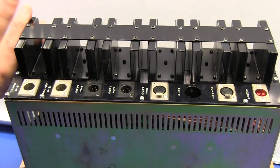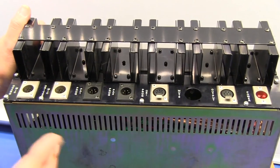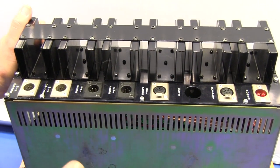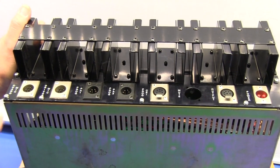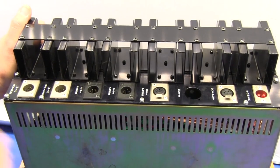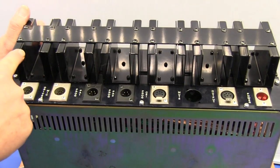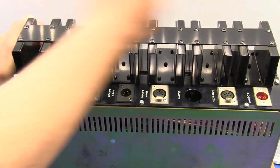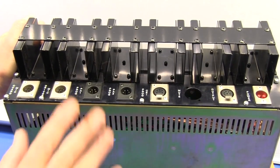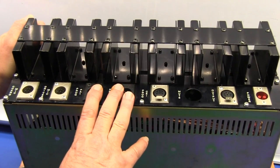Well, what's the deal? At the stage that these amplifiers were designed, the company I was working for, Jans Electronics, were very good at sheet metal and had excellent sheet metal facilities. And it was viewed at the time to be expedient to design the heatsinks from sheet rather than extrusion or any other form. So we designed them out of stacked U-sections with this bar across the back so that it made it more difficult to bend an individual fin out of shape.